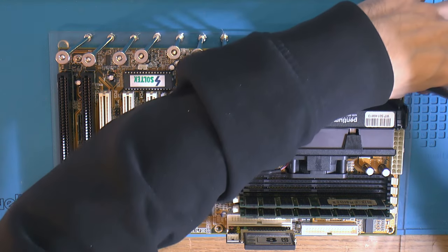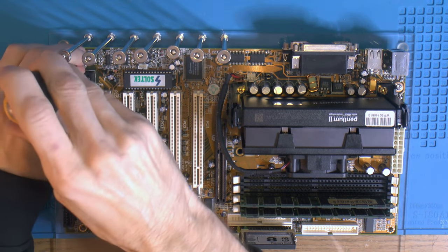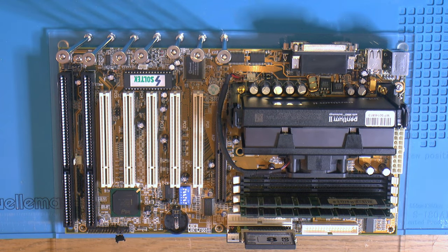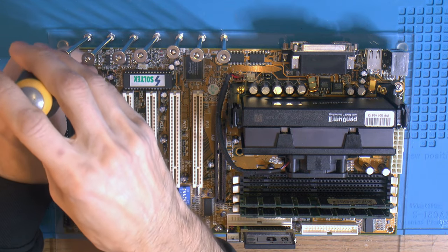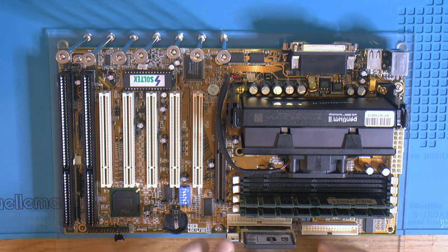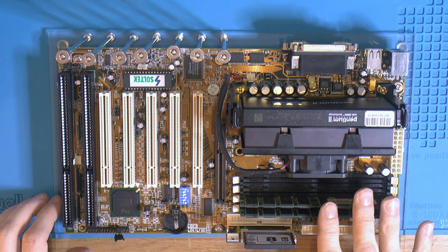So my plan here is to run the CPU at 450 MHz, since we had a cache for that. Apparently Axel, who donated the TNT2, is still somewhat broken. Had the same cache on, I don't know if it was a P2 or P3, but he got his up to like 600. Stable, I don't know. I think it's suicide. I don't have a 124 MHz bus option on this board. I only have 133 after 112. We don't have any V-core options either, so we would have to do a tape mod if we wanted that, or modify the board to actually increase the V-core of the CPU. But I'm not that interested in overclocking this that much. I'm perfectly fine with 112 bus, which gives us 450 here and 112 here. And then running CAS2 and so on and subtimings.